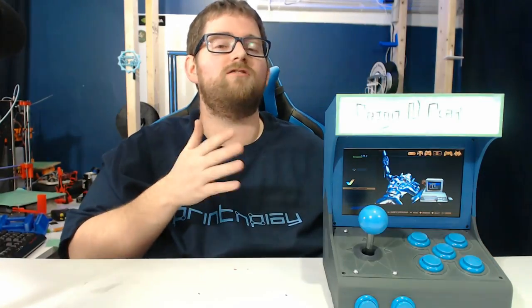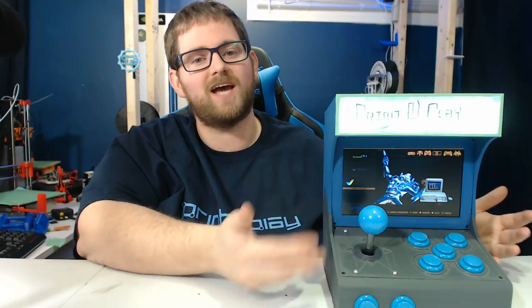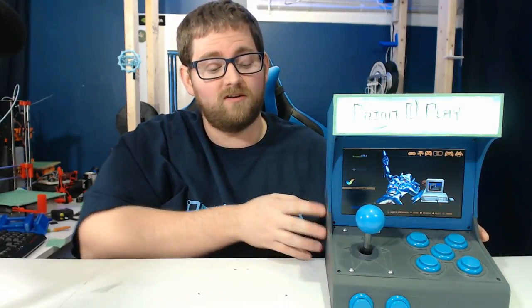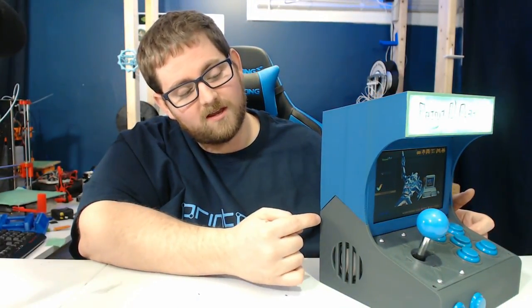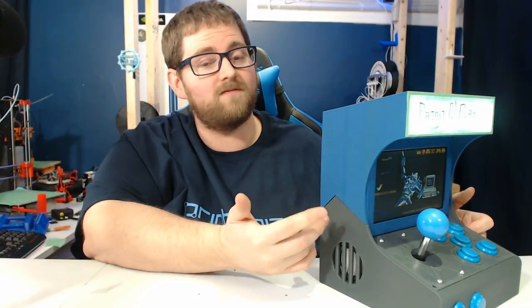I've picked the components so everything can run off 5 volts, so a 2.5 or 3 amp power supply is all you need to power the entire thing, which means you don't have to mess around with wiring mains voltage. You can just put a jack on the back, plug it in and call it a day. The base of the unit prints as one piece except for the control panel, and the top prints as another piece except for the bezel on the screen. I've designed it so you can pick two colors and they meet up with this nice V shape, which covers up the fact that it's two separate pieces and makes it more stylistic.